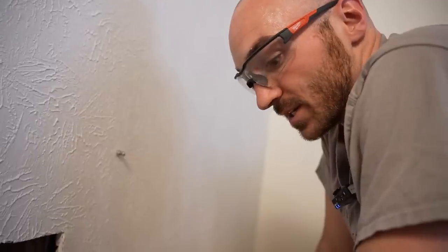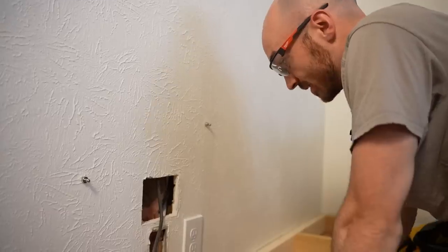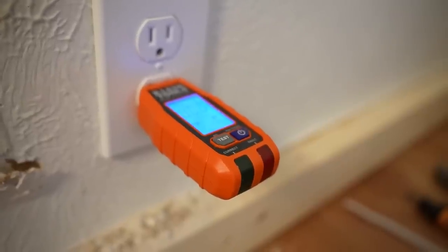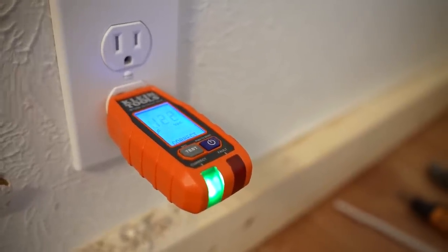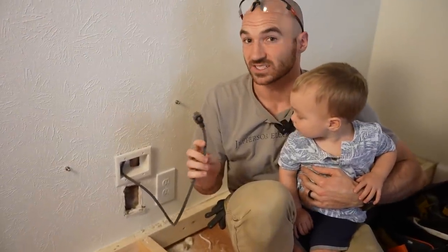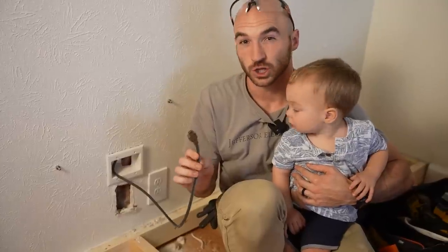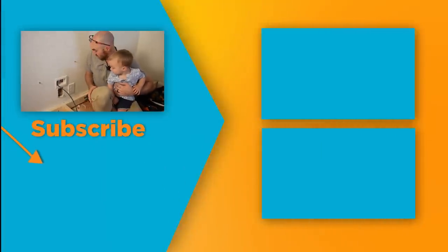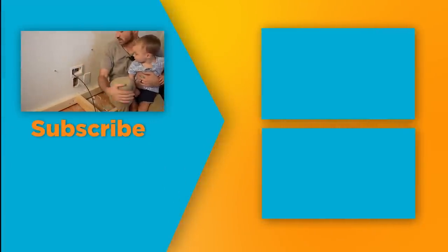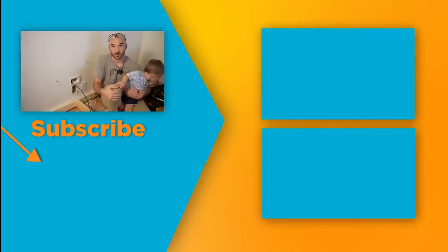All that's left now is drywall repair and testing of this receptacle. So let's do that and then we'll be off — down to the breaker panel. This is a bit of a soft wrap to this project because I haven't finalized where my low voltage cable is going. That said, that's not high risk and doesn't actually need proper electrical enclosure — it's allowed to run behind the wall open. We've moved the six inches that we needed and I'm still deciding what this placement will be. Subscribe to Electric Pro Academy for real skills to make real money.